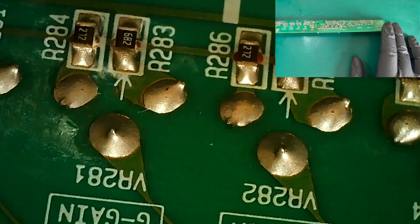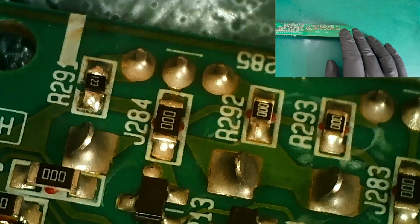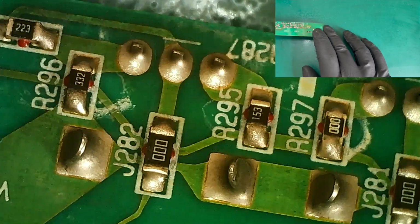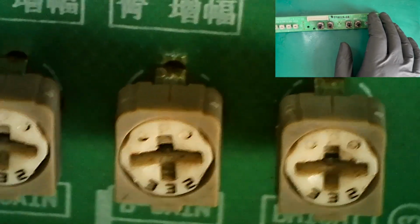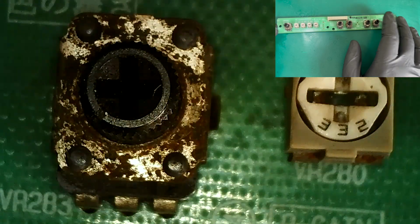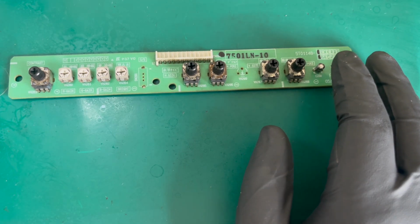And then if we look at some of the pots, let's just go from the edge here. Three pins on the front look good. That all looks good. Looks pretty good. Yeah, so like I say, this monitor was working and this particular remote board is in better condition than my other one. So it's not unexpected to have not seen any sort of cracking or ringing on those joints. So let's get this off, clean this up, ready for replacements and auditing purposes.